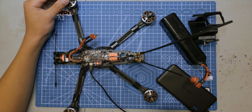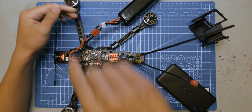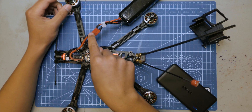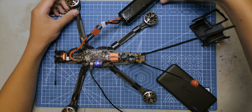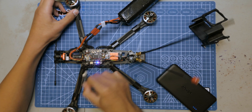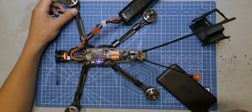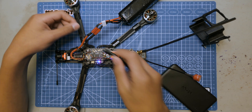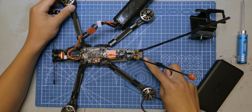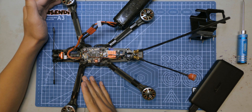Only the flight controller and the GPS power up. Then you just wait 60 or 90 seconds to make sure that the GPS has gotten its sats. When you plug in your flight battery, do not unplug the USB before you plug in the flight battery. You want to plug in your flight battery first so that everything is powered, then you can unplug the USB. That way, the GPS stays powered the whole time and doesn't have to re-find sats.